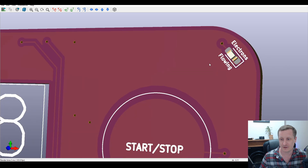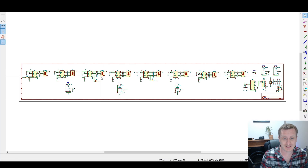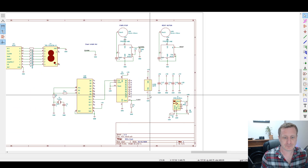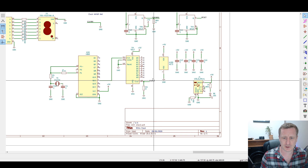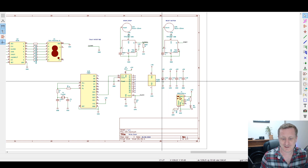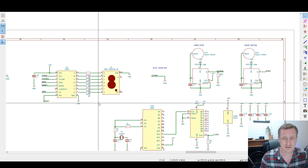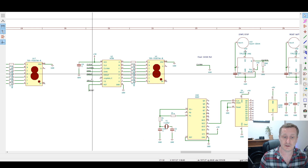The schematic is quite long but laid out in a modular style mirroring the board. The 4060 and 4017 provide the clock signal via a net label. There's power-related circuitry with capacitors, the USB connector with the LED, and touch sensor ICs for start/stop and reset. The clock inhibit net goes to ground — it was originally used across all ICs, but only the first 4026 needs to be inhibited since everything carries out from it.